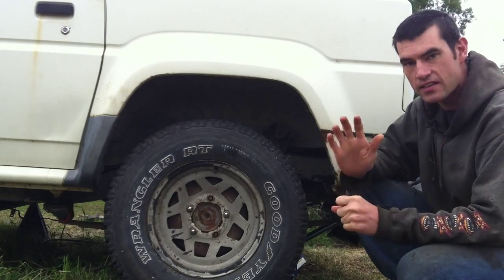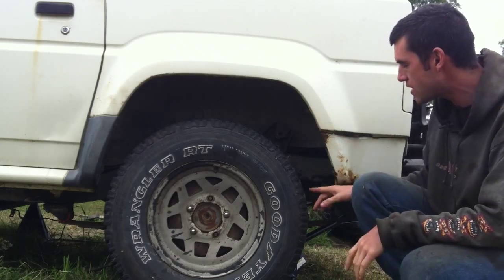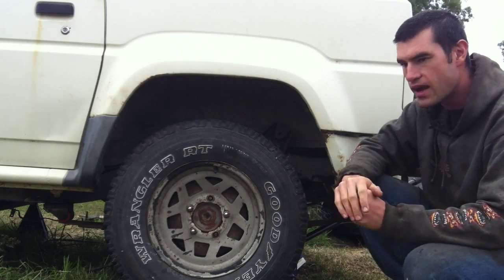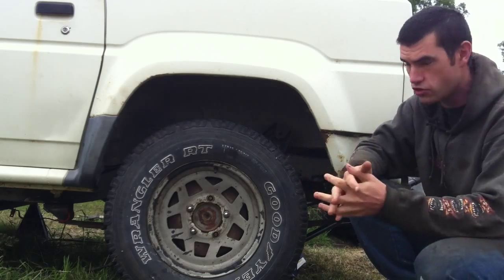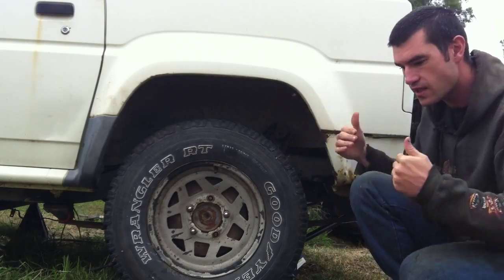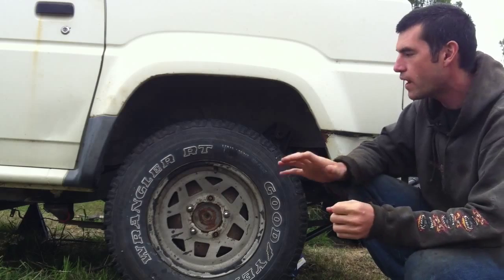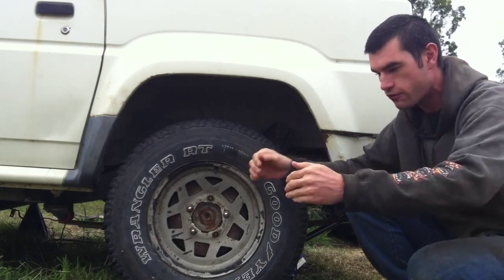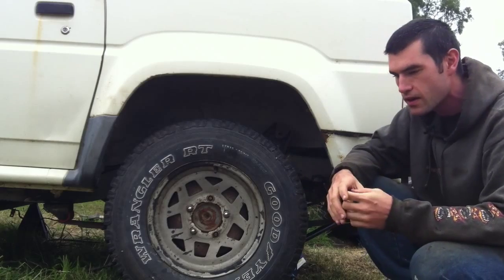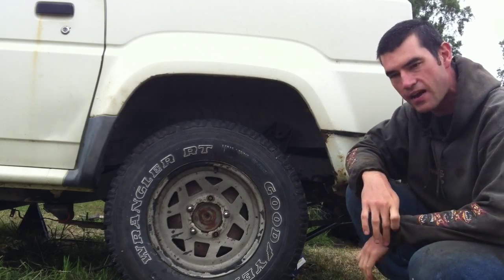First thing though, I've got to get the chassis ground down to where it's usable for my purposes. I'm also going to take measurements once again to know exactly how much space I need to move the axle back. Online on the Beginners Fab group on Facebook, a couple of people suggested making adjustable kingpin holes you can slide forward or backwards on the spring perch — and in fact that is exactly what I already did. What's happened is that I am at the furthest point forward on the spring perch with that pilot hole for the kingpin centering pin, and I can't move the axle back any further on the actual spring perch I have.